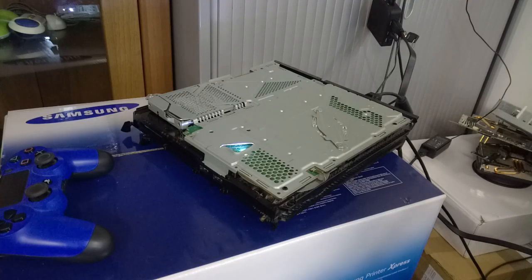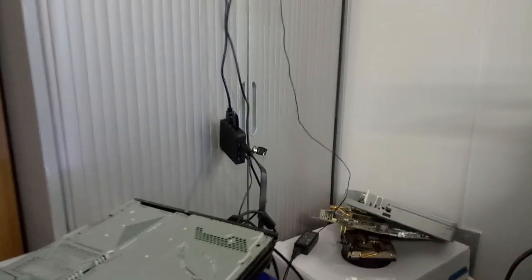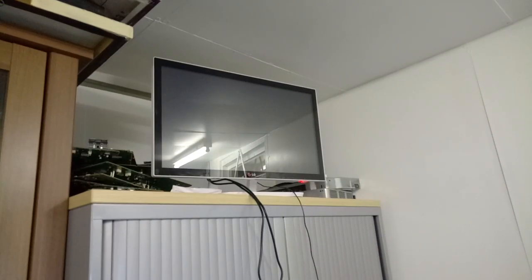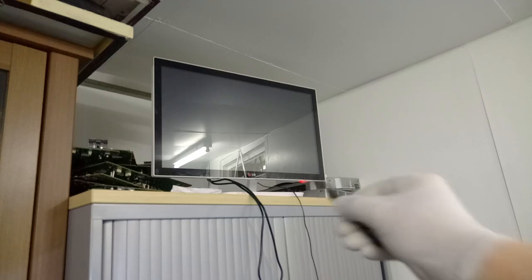So we've replaced those coils. Whilst it's progress, it's not perfect. You can see we have a white light. If we have a look here on the monitor, we get the occasional flash. You just caught it there - you get an occasional flash. And you can see the red light is actually lit and staying lit, which means that the monitor can actually see a signal and it's actually synced. But obviously the output - yeah, it's not quite what we want. So it's flashing away.